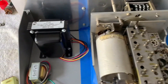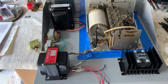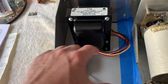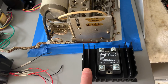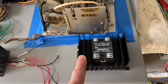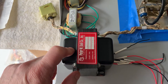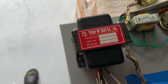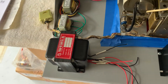What I'm going to do is get the wattage down on the transmitter. I don't want to use rectifier tubes or anything that's going to draw extra current. So I decided I'm going to use this transformer. This is the solid-state DC relay for the keep-alive supply for the three-diode negative peak limiter. And I think I could just use this old desk KW screen transformer — it used to power up two 4-400s or 4-250s desk KW screens, it's like 125 milliamps. That should be enough for the keep-alive supply.